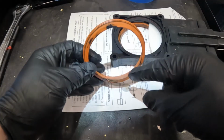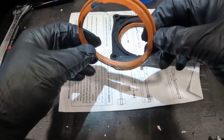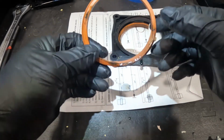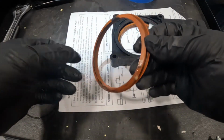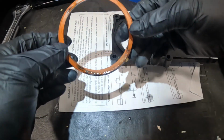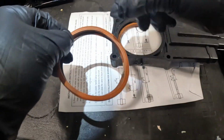One, you can have debris in the valve and you're sitting there trying to jam that blade valve closed through the handle because it won't shut, and it can damage the seal. But judging by the rip I have in the seal here, my guess on this one was maybe they tried to rod it out, shoved a stick down there, and that can actually just cause problems as well, because that rod or stick will go past the valve and just tear these seals.